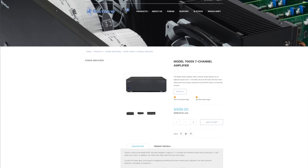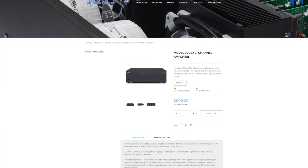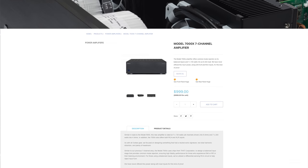As for comparisons to the A7 specifically, one that comes to mind is Outlaw Audio's 7000X. The 7000X amplifier does cost more money, but you are getting a little bit more power at 130 watts into 8 ohms versus the A7's 90. The 7000X also gives you balanced inputs, so whether you need just a little bit more power or that connection option is going to dictate whether you go with the 7000X over the A7.